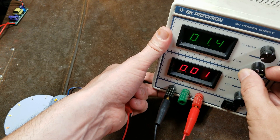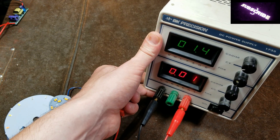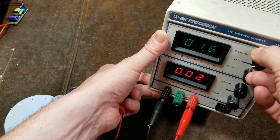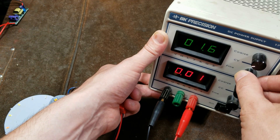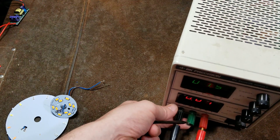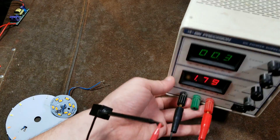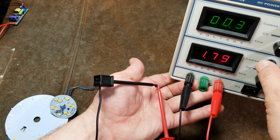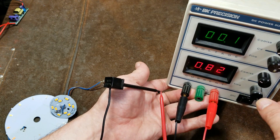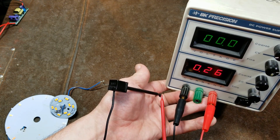We can bring this up — you can't even really tell how fine that control is because it'll only boost about 0.1 to 0.2 volts of variation. Let's say we have something here. It allows you to set it a little bit more precisely — you just get it rough with the coarse control, and if I wanted 1.5 volts, I'd go right there. On more modern ones, it will tell you the current you're set to without having to short the power supply. But with these old ones, you just quickly connect it up. We can see that we're limited. If we drop this down, we can actually drop the power — we can see all the voltage disappear because this is a gross overload. That's a demonstration of current limiting — we can set this up to be very low power, and it provides a level of protection.